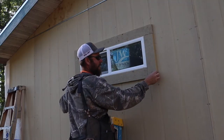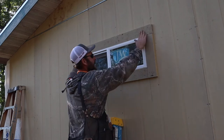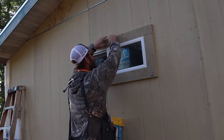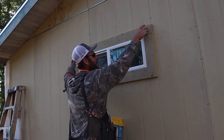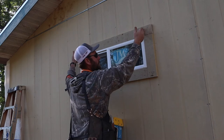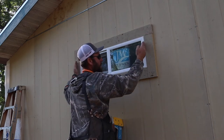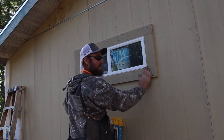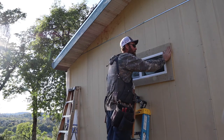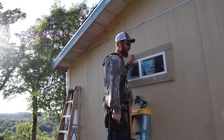The theory behind this style of trimming — with the header over the top of both edges — is to think like a raindrop. The water comes down, and if you had trim pieces coming up through it, the water would follow that crack and potentially get into the building. That's basically it. I'll finish nailing that up and I'll see you on the next one.